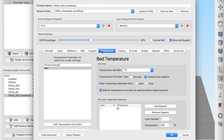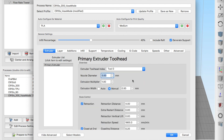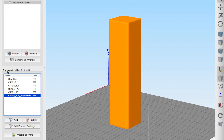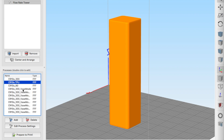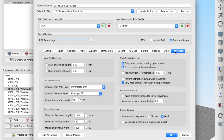We're going to lock down our temperature — I'm using 210 degrees C — nozzle size 0.5, and speed at 2,000 millimeters a minute, which is 33 and a third millimeters per second. In Simplify3D, take a process, copy it down, and in each one adjust the nozzle diameter. For the first one, nozzle diameter 0.5 and extrusion width 0.5. The next one, set extrusion width 10% higher to 0.55; if using a 0.4 mm nozzle, do 0.44 and so on. Remember to set the start layer and end layer at different heights — I'm doing this every 20 millimeters — and set it to vase mode.